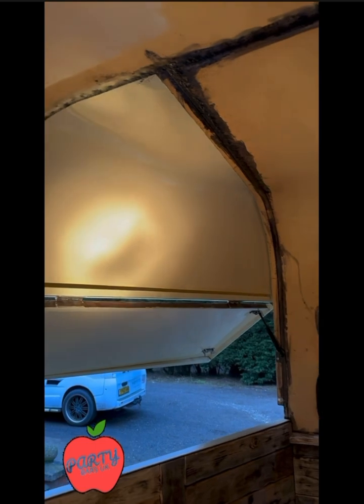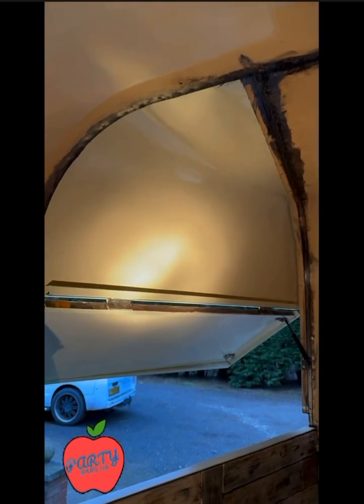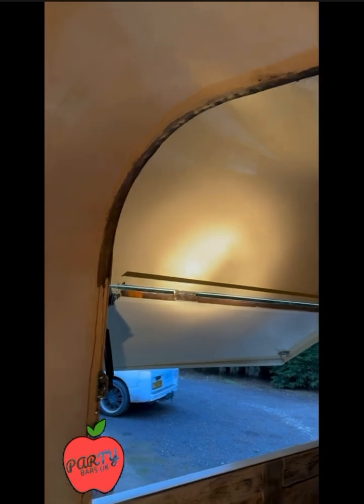Some of these trailers that I do, that's where they seem to go the worst on this edge, because this door, I'll just get round here so you can see, that top door there doesn't get sealed, so when it rains all the water runs down there and down there and across in there, and it drips and it just rots them out. So I seal them all the way through. Once you can see, that's welded anyway there on the outside. Seal that all in.